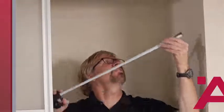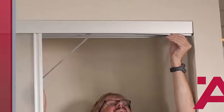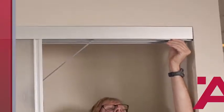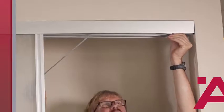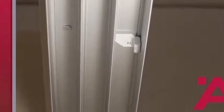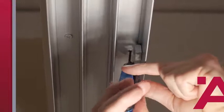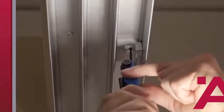I have installed the soft-close trigger as instructed in the soft-close literature. It's just a good rule of thumb to start at about 200 millimeters, but you'll need to make adjustments once the door begins to function. Now that we've got the trigger positioned, we're going to tighten this three-millimeter set screw just so the trigger doesn't move while we're functioning the door.